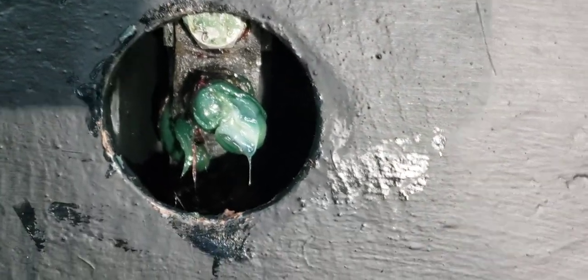But then, yeah, you can see the grease fitting here. And it just took a lot of grease. But, yep, I'm going to clean it up with a rag and it's good to go. It just had to lock in, and then you can see here where the piston extended. It should extend it out here. Oh yeah, see that, the piston extended. So it took a lot of grease to get that filled up to be able to extend it. If you can see it too good here, but yeah. So that's about 4 or 5 inches, about 5 inches in. There you go.